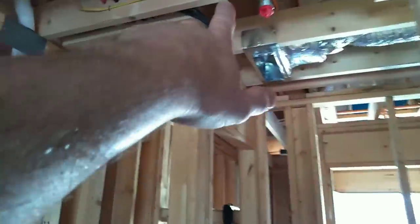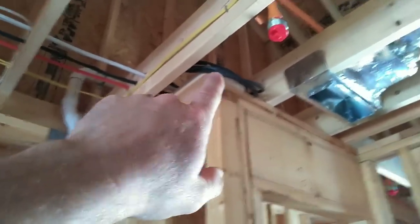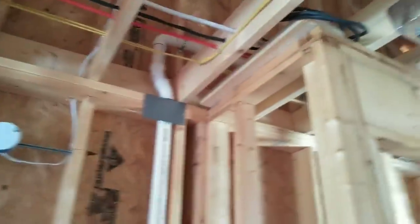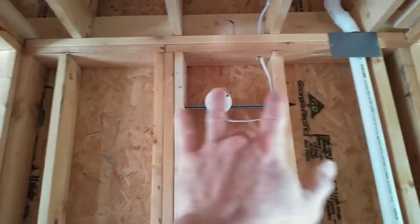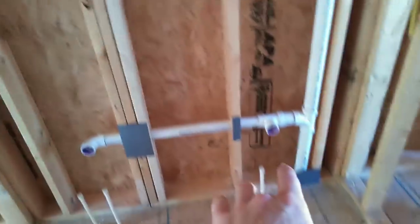Going into this master bathroom — got one-piece fiberglass. They do have a sprinkler. I've got my wire coiled up — it looks like it drooped down a little; that's for the air handler going up in the attic space. The HVAC guys have already prepped it. I need to push that up a little higher so it doesn't get pinched in sheetrock. We have a slide-rail box going to have a six-light single-bar light going over the double-bowl vanity.